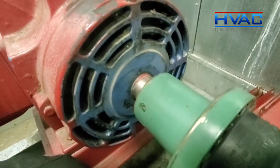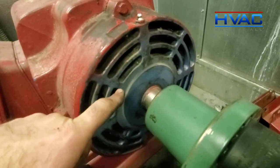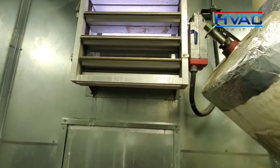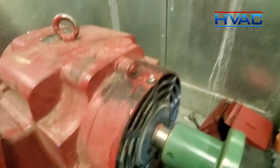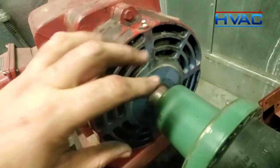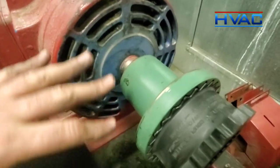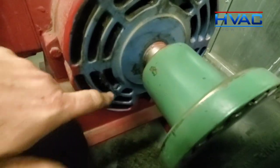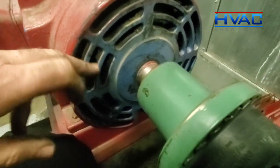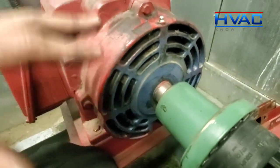While this motor is slid back, I'm just cleaning out any debris because we have an outdoor air damper here basically to let fresh air in to cool the room. So I'm cleaning out these openings so the motor can have proper ventilation. We have some lint or dust accumulating right here, so we're going to clean all these surfaces out so we have proper ventilation to cool this motor.